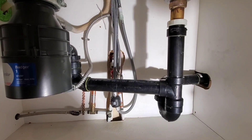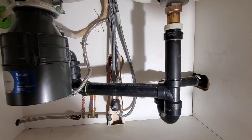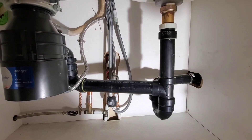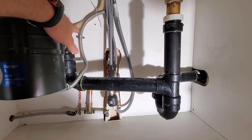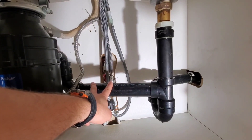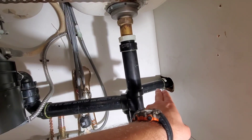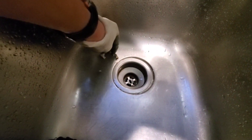Guys, this is now a re-piped kitchen sink. The monstrosity that was here before was just pure garbage. The idea now is: undo that, undo that, undo that, slide the whole thing down, and you can clean out your trap without any issues. If there was no garburator here, this dishwasher drain would go between the two compartments, open to air on each side of the kitchen sink, and you can put your dishwasher Y on the back side of the trap. The very last thing we're going to do is scrape away the excess putty squeezed out from the drain.